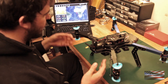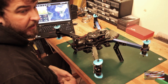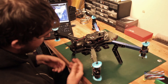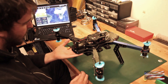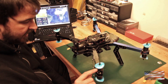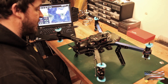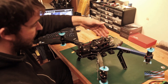Now we've got all four legs attached. We can take a look at the X8 Plus. Some of the differences you'll notice if you're familiar with the 2013 or the old standard X8: the biggest one in my eye is the frame — they've really stretched this frame out. It gives you the ability to get the battery back far enough, which was one of the shortcomings with the old frame. They're also using Sunny Sky motors, slightly larger and a little heavier duty. This has got the Pixhawk on it, which they've been shipping with for a year or so now — it used to have the APM. And we talked earlier about the FR Sky telemetry, which is a really nice feature.